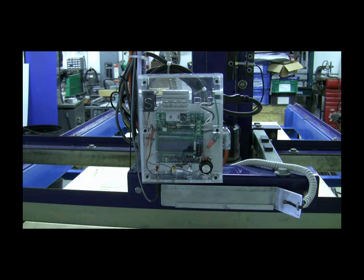I'm going to show you how this thing works. First thing we're going to do is turn on the 5-volt power supply, which can either come from your computer if you're running it with Mach 3, or if you're not running on Mach 3, you just need to get a wall wart that puts out 5 volts DC regulated.